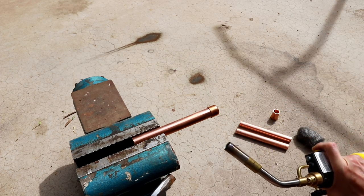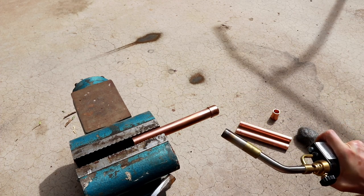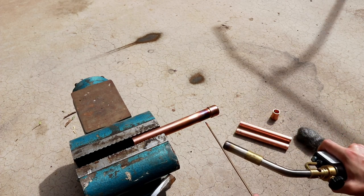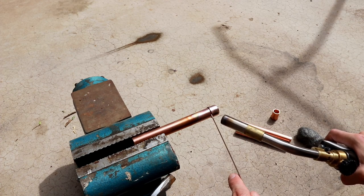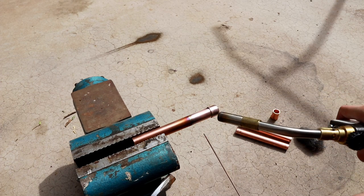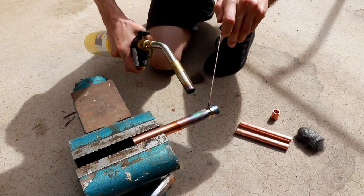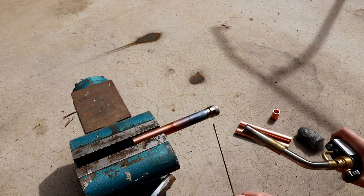What I'm doing now is evenly heating the pipe. I want to heat it until it starts to discolor and maybe even starts to glow very slightly, but I don't want to get it so hot that it burns through. Now it's starting to discolor so it's almost time to put the braze in. You can tap-test to see if the braze is melting yet — it's almost there, still got a little ways to go. I'm going to get around the other side and hit it from the bottom as well.